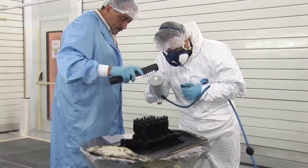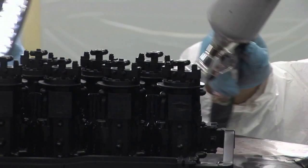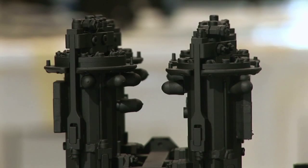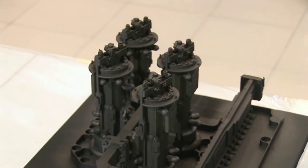The paint application process will be adapted to the geometry of the surface to be coated. After application, the parts should remain in the application room during the evaporation of solvent, around 1 hour. Final curing is according to each technical data sheet.